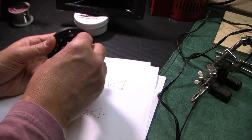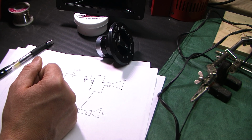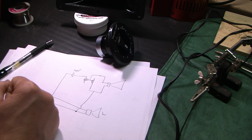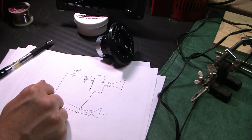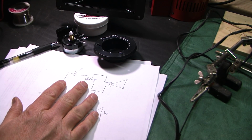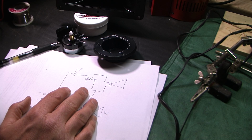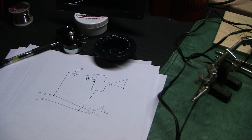Okay, enough of that. I'll put this video together, and then I'm going to start actually physically modifying. We'll start by soldering the capacitors to the backs of the tweeters, and then drill the hole for this. I'm too tired to think about it tonight. Anyway, at least we figured out the crossover frequency and the capacitor to use, and experimentally verified that it's what I want, and we'll go from there. Thanks for watching. I'll pick up next time with the mechanical part of this process.